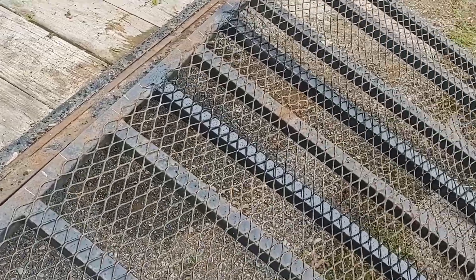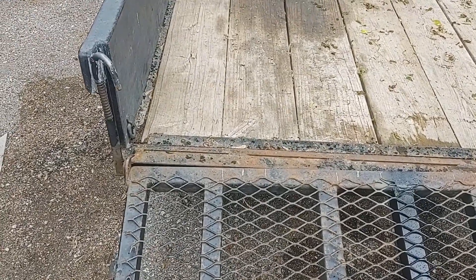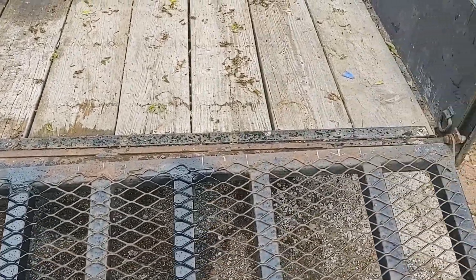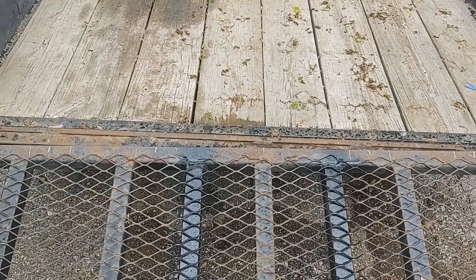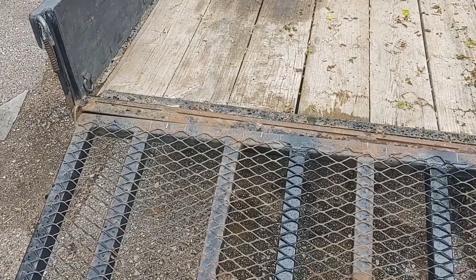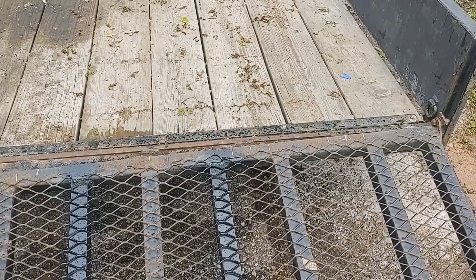I have the hinges laid out. I was able to put one at every 12 inches — you can see the little lines there where I lined them out. Now I need to go in and drill out the holes. Normally the bolt would be in the way, but I'm mounting them upside down from what you'd normally do, and I'm not bolting them — I'm going to weld them. So I need to drill the holes out to make it a little easier to weld.